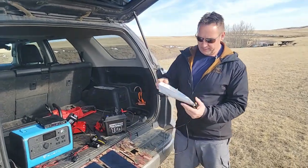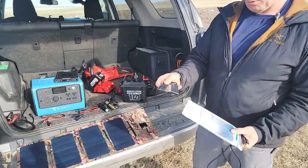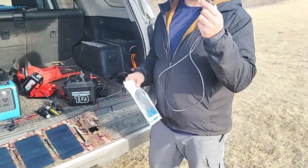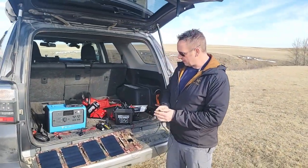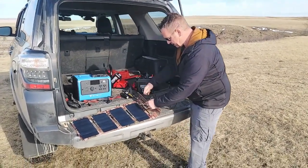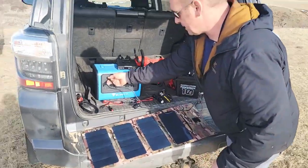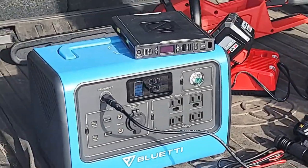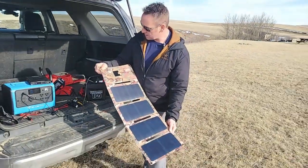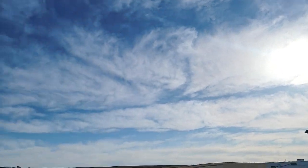What I did as well — and we'll eventually offer this — I just bought a pack of different adapters. It's DC5521 and there are several adapters in here. I've got this one to an eight millimeter plug. So I'm going to plug this into the back of the 28.5 watt, then plug it into the Bluetti. Now we're near the end of the day, so it's really not going to provide a huge amount of wattage. I'd say we're going to be lucky with the clouds to even get 10 watts. There you go — there's like four watts going in with the clouds, eight watts.